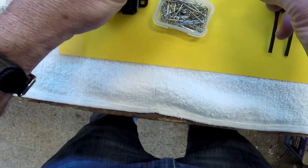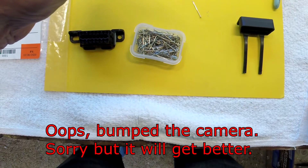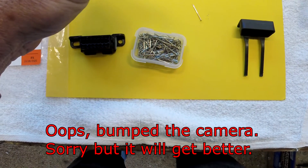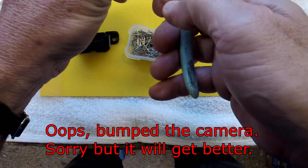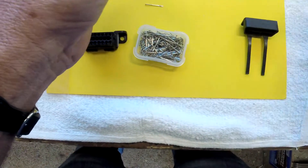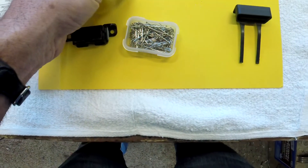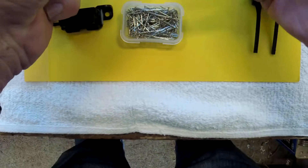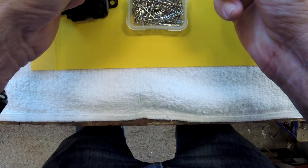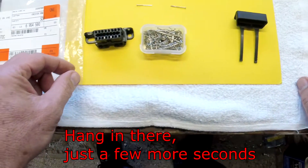Okay, so I'm not sure you're going to be able to see this, but it flattened out the pins, but it left a point on the end. So we're going to cut the point off. Take the second one, cut the point off. Now we have two flat pins, and I'll show you how the wires get released now.